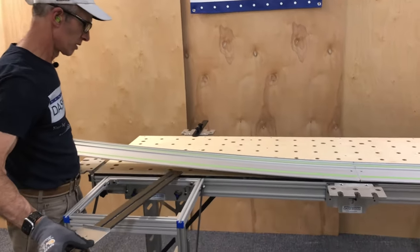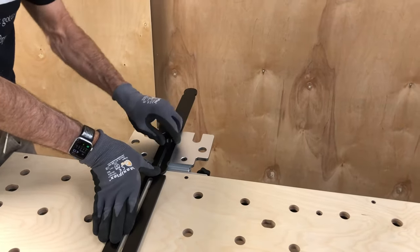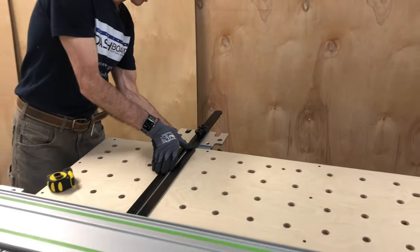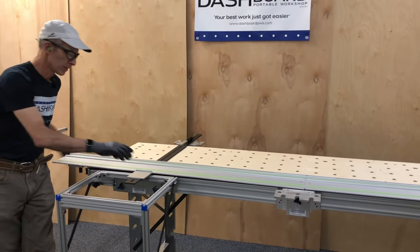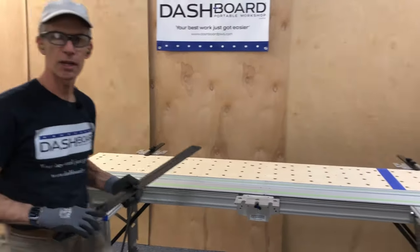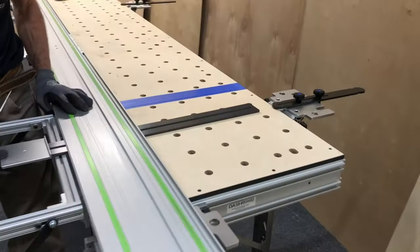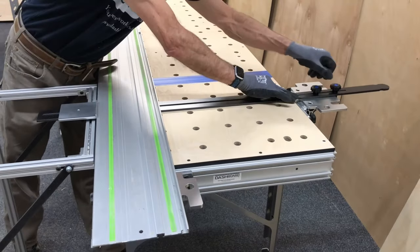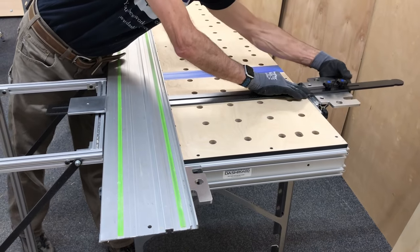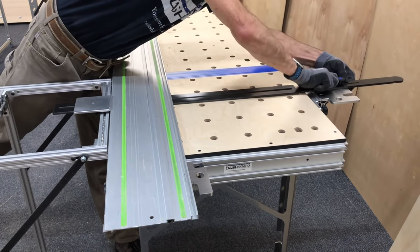Now I'm going to lift this up, pop it under here, and put it up against the splinter guard. I'll hold this in place and move the parallel guide until it contacts the rip gauge, then tighten the expand dog in the hole and tighten the other expand dog in the slot behind it — nice and solid. Then lift this up and do the same thing on the other end: set it over there, pull it against there, tighten this, pull that in the slot and tighten it.